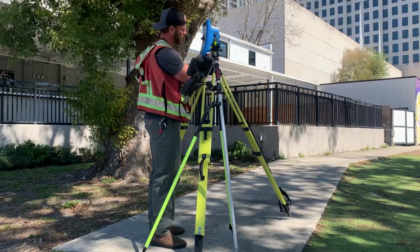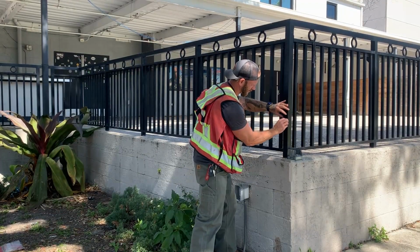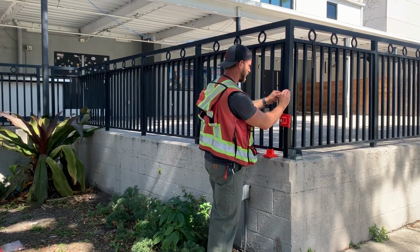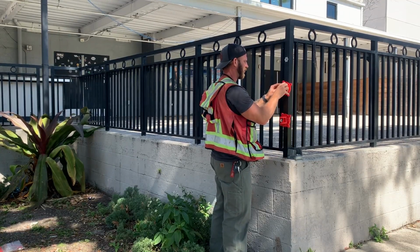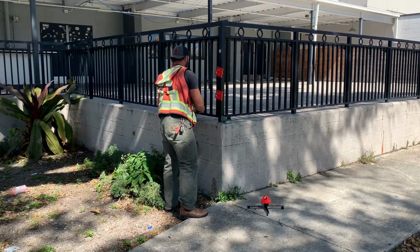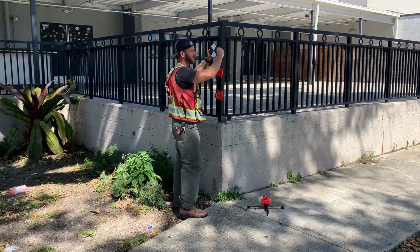So I set up a total station with a distant, stable backsite with 4 discs nearby. One was the control, a stable prism that didn't move for the duration of the testing. The second was also a securely mounted disc, which after each round of observations, I would take the prism off, rotate it, adjust the angle and put it back on. This should show any slop in the mounting system, swiveling base, and the rotation of the prism. The third was also a secure fixed point, but between each round, I would take the prism off and replace it with a target that I would shoot reflectorlessly. This is testing the alignment of a prism to a target.